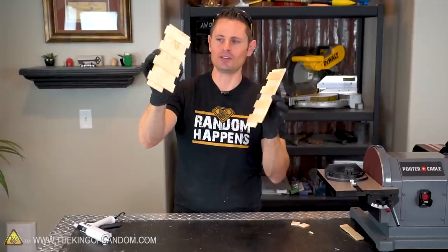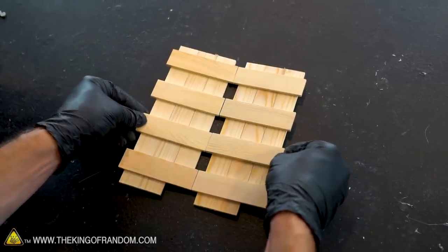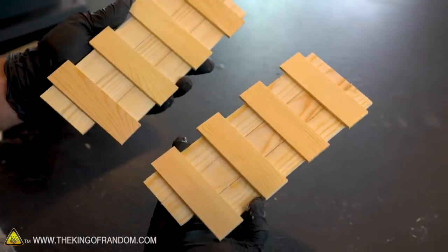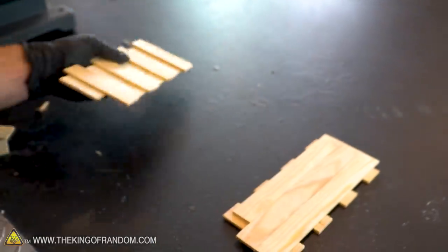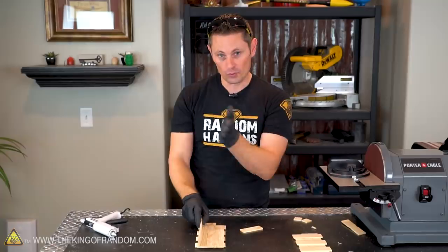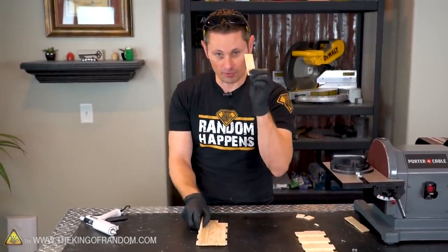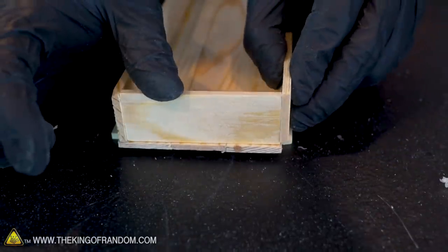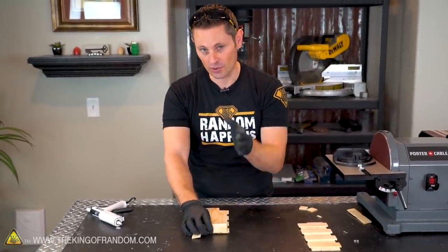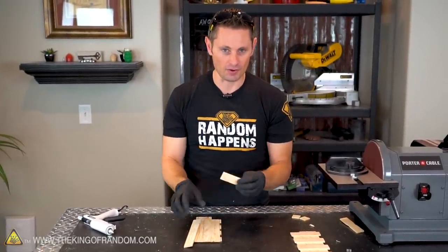We just got our wooden straps assembled and they're looking really good — spaced very evenly. Set them down the table and push them side-by-side and you can see they line up absolutely perfectly. Now choose your least favorite one — the one you want to go on the bottom — and set that down with the wooden straps facing down. We're using the last eight-and-a-half-inch piece as the side wall for the right side of the box. Glue that down in a straight line, then grab one of the three-inch pieces. Before we glue it down, measure — this is going to be the inside back of the box. You want to see a gap at least the same width as a paint stick on the other side. If it's a little bit longer, use your belt sander or sandpaper to sand it down to the right width.